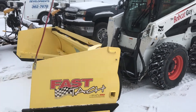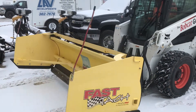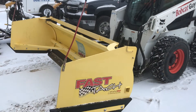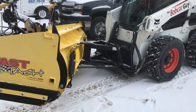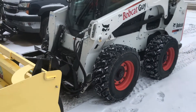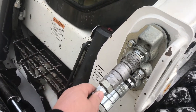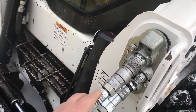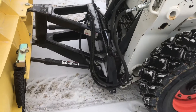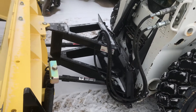This is that extremely low idle of the bobcat. What we're gonna do is tear the lines out and see if we can put in regulators and shut down the orifices so the oil runs slower through them. This will produce more heat, but in the middle of winter that shouldn't matter, and that should stop this from slamming down a little bit.